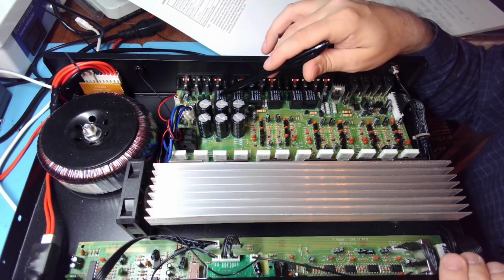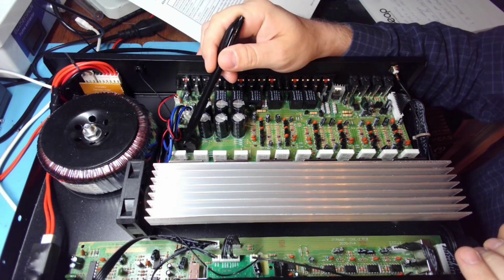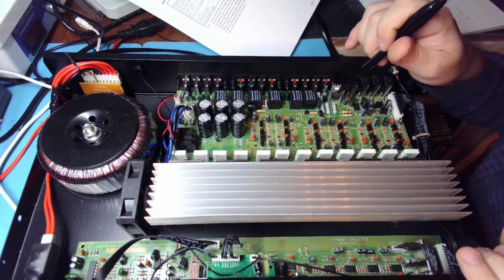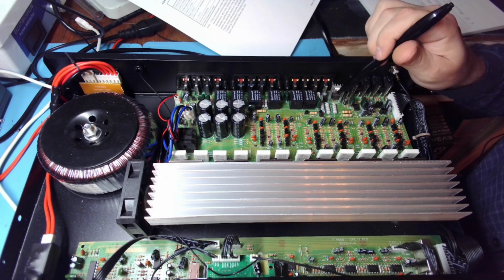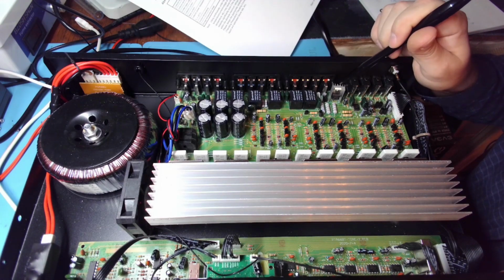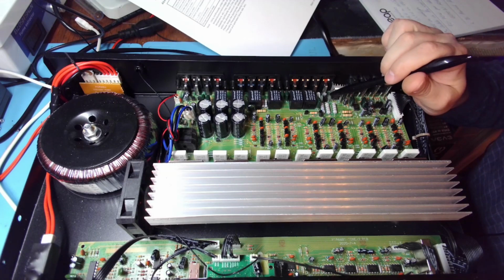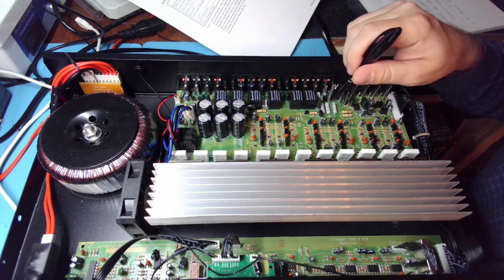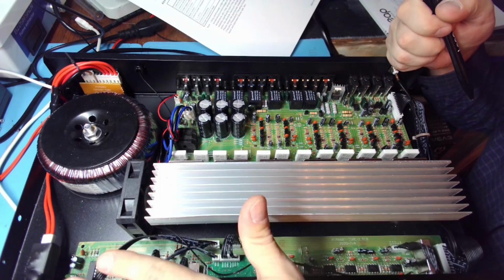And that is pretty much it. Obviously, the relays, and we had three bridge rectifiers. Usually on these devices I only see one actually soldered and a whole bunch of missing capacitors. Speaking of capacitors, this one has no missing capacitors on the 5 volt regulator, and the regulator is on the heatsink, so it's a lot better than the previous one that had none of these and was missing the input capacitor. But it's the same thing, we're pushing about 30 volts on the input, and that supplies our entire 5 volt logic on this side.